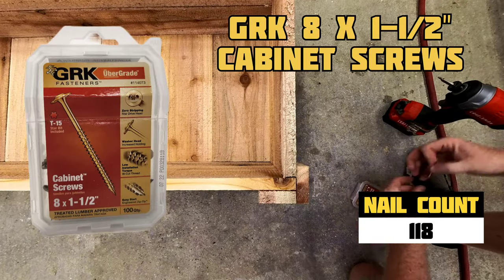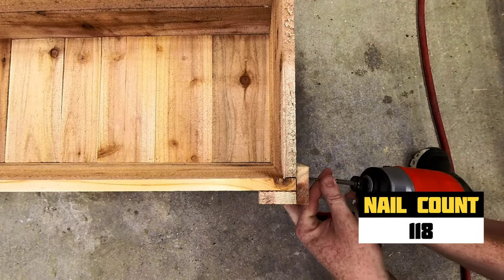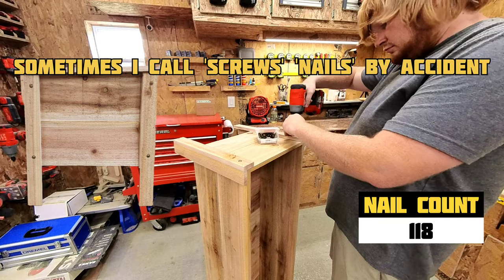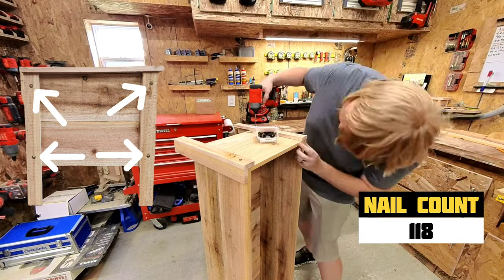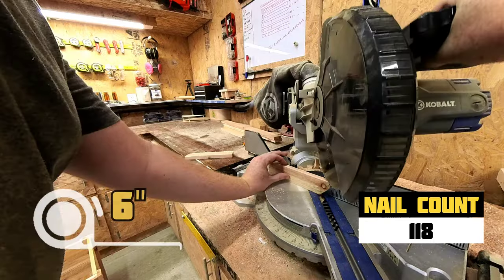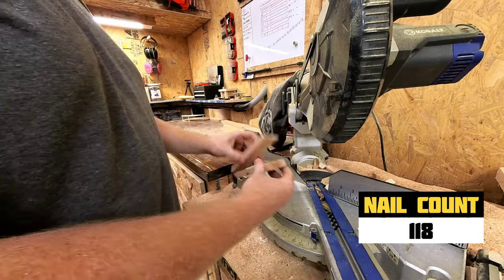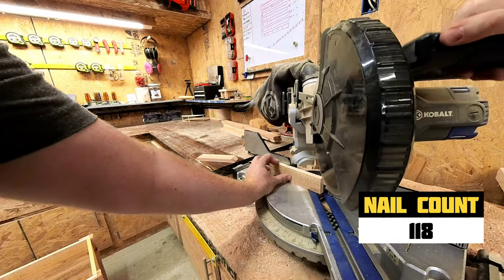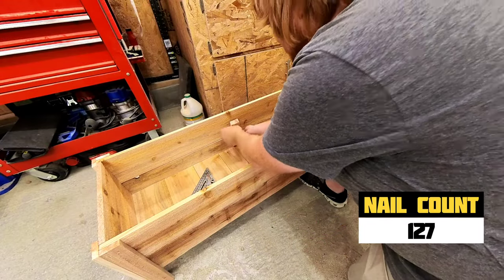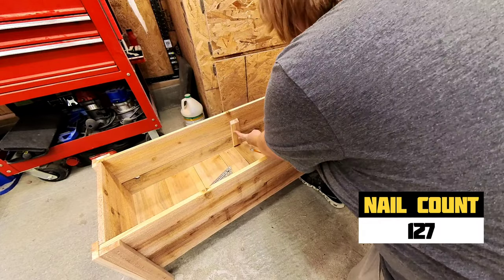I zip a few GRK 1.5 inch cabinet screws through the leg on the long side. I do this now so I can line up my screw before the top lip is installed. These screws can be used with treated lumber if you decide to go that route instead of using cedar. I borrow two smaller pieces from the scrap pile and cut them at a miter to 6 inches long — these will support the long sides so the upper board has support when dirt is added. Find the center of the long sides and use a square to make sure they are perfectly placed, though you could also eyeball it since the dirt will cover it up.